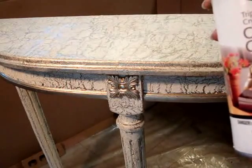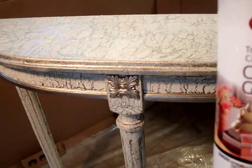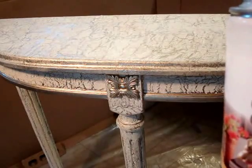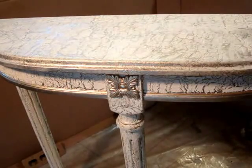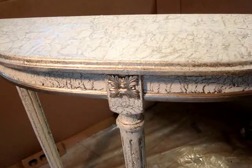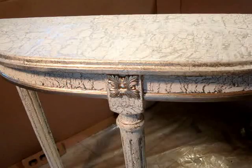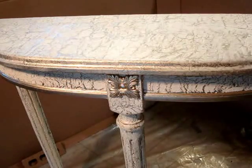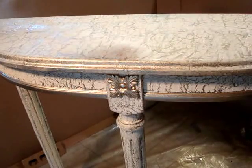This stuff goes on really thick as it states — triple thick. It's going to look a little milky, but that's okay because when it dries in a couple of hours it's going to be clear. That's one of the reasons why if you're going to have a textured piece like this, you want the thickness of the glaze, which will kind of even out the finish. This is where I made my critical mistake last time by applying colored glaze — now we've learned that's a don't in this particular project. So now I'm just going to start applying our clear, standing about 10 to 12 inches away, in a well-ventilated area. I'm going to start out on the top.